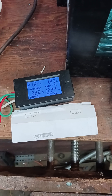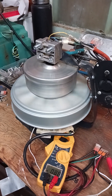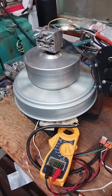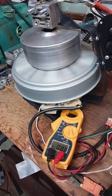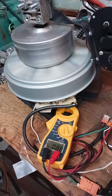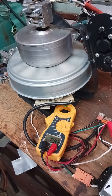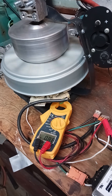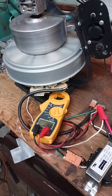All you need to do is modify a hoverboard motor. The video on my website shows how to do it. You can marry it to a washing machine motor — a magnetic three-phase washing machine motor. The only modification I've done to that washing machine motor is put a white wire in it as a neutral. On the very end of all the windings, you'll find all three legs tied together. You attach it right there, and that gives you a neutral that will work with each of the three phases.